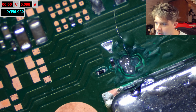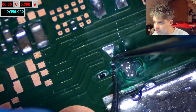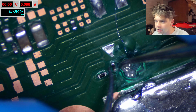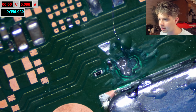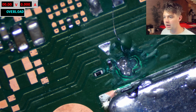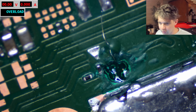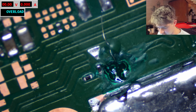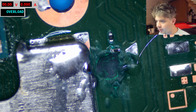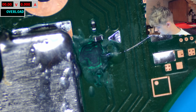I want to check the command resistor because I don't remember if we had seen it was blown or not. I'm going to turn this off and measure this resistor right here — it looks like maybe it got ground through at some point. Let's see if this resistor is 4.7 kilohms or not. Yeah, that thing is shot. So that is also going to prevent boot. We're going to unfortunately have to pull that off and solder a new one. But I think I'm happy enough with our trace repair that we can cover this in mask so that when we hit the resistor with hot air to replace it, we don't screw with any of that. This bent probe pin is the best tool in the world for micro soldering — I would pay a hundred dollars for this pin.